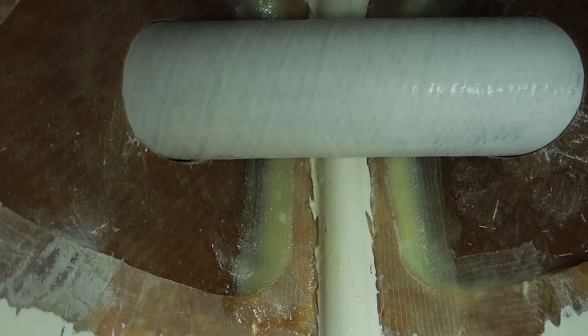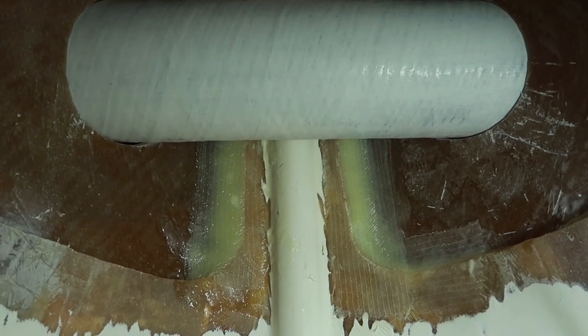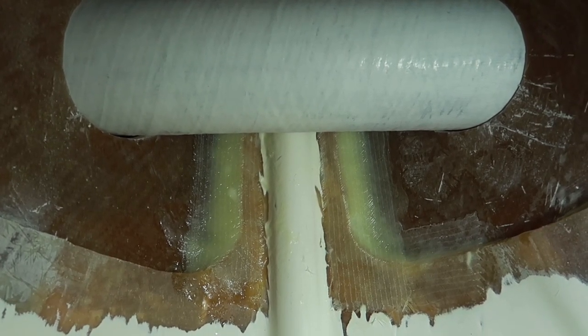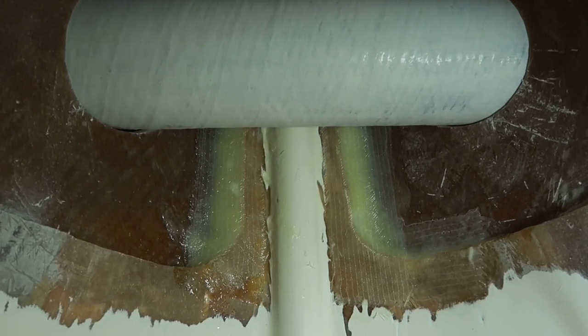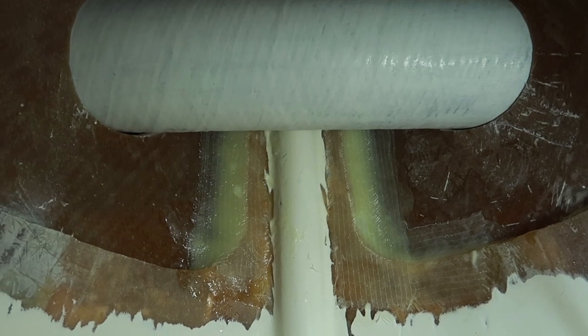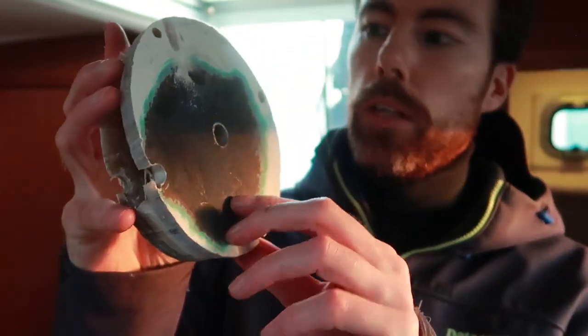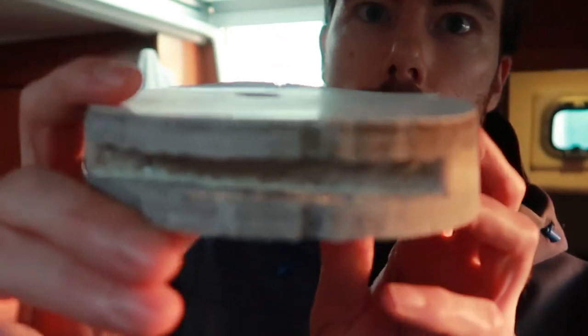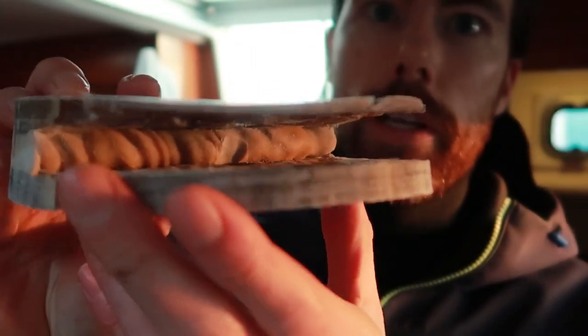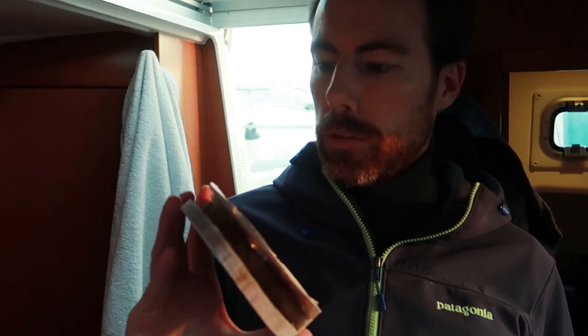The viewer who paid attention might have noticed this glassing that magically appeared here. Honestly I couldn't be bothered turning on the camera — I had to go home and pick up more supplies and just wanted it done. It's very basic fiberglassing. If you want to check out fiberglassing, I recommend Boatwork Today or Sail Life, links in the description below. Just to show you the cutoff here: this is the external main hull, and this is the inner liner. One side is quite thick, turn around and you have the very flimsy side. Beneteau made the outer hull very uniform in wall thickness, but the inner liner not so much — it's more for looks and housing installations.